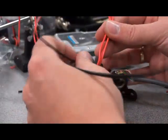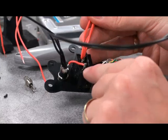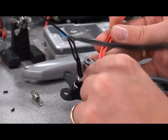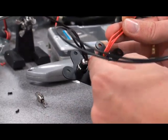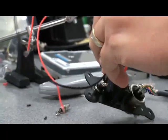Now we have the power cables in place. This is the minus in our case, and that's the plus, that's the ground. We don't need that for DC power. And then the plus goes here, that's our switch on off, and then 3 power supplies go there. We'll gunk this up with the hot glue just to prevent any kind of shorting, because this stuff is pretty close to each other. And then we pair these guys together to design our power cable, and we'll try to find ones that are approximately the same length.